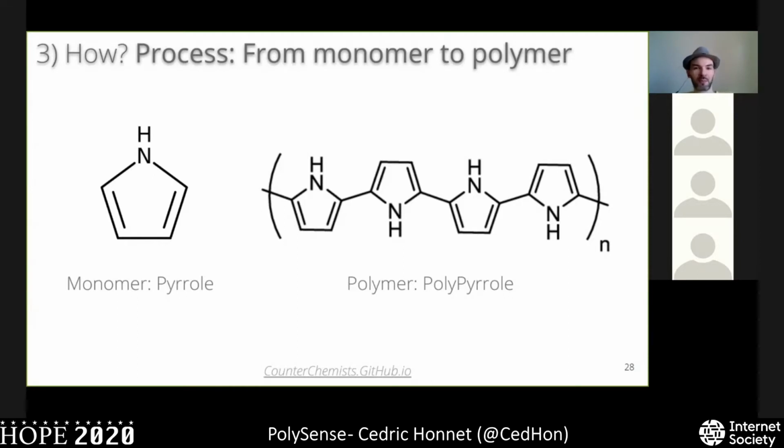You can imagine that the fiber itself becomes conductive. And this is called in situ polymerization because the monomer is already everywhere around the fiber, already soaked in the fiber somehow. And when you trigger the polymerization, it will connect with all of its friends and create those conductive particles that are very long. And this is the trick. We tried so many approaches and we couldn't imagine that first there was this thing, pyrrole, that existed, we didn't even know. But making it in 2 steps like that is the technique. So if there's something that you have to remember in this process, it's that it's in situ and it's this 2-step process that creates those conductive chains.